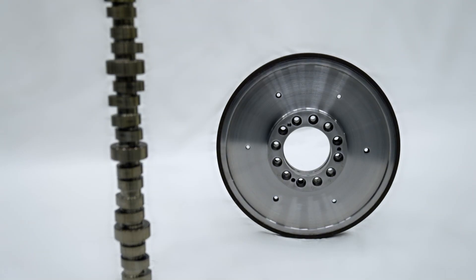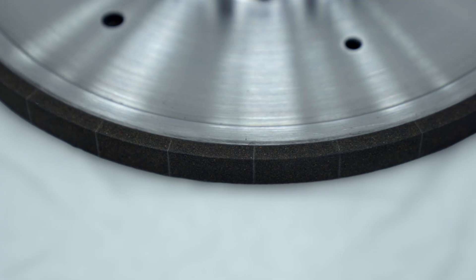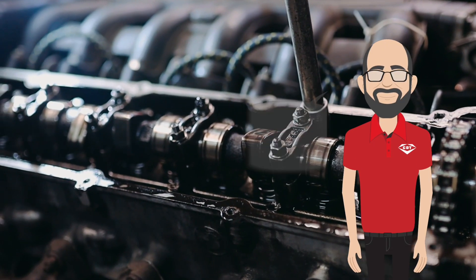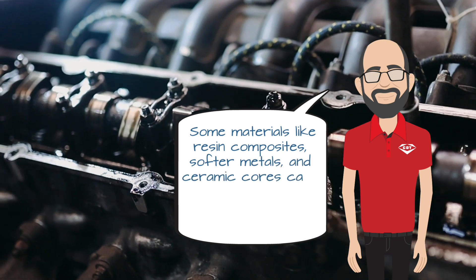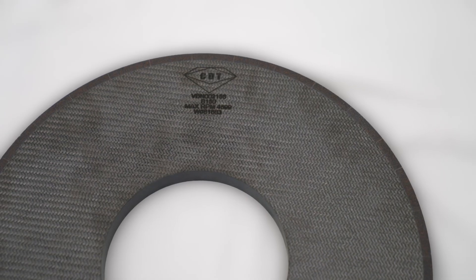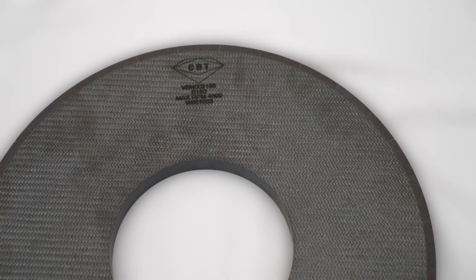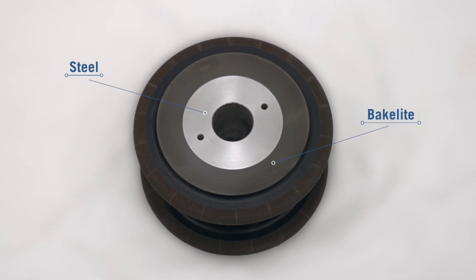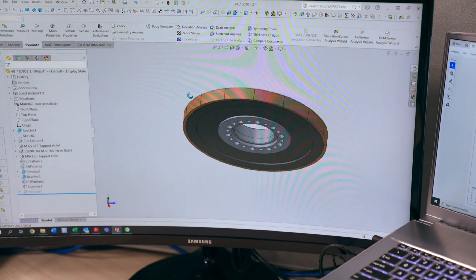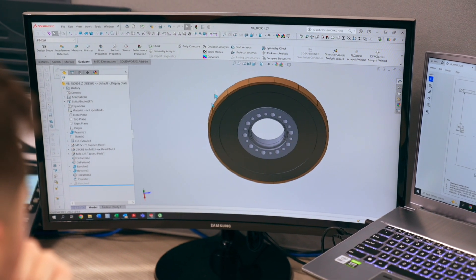However, when you're running at high speeds like camshaft grinding, the process generates a lot of heat with extremely demanding grinding forces. Some materials like resin composites, softer metals, and ceramic cores can't handle the forces required for this application. You're going to need high stiffness, which means a carbon fiber or high tensile strength steel core. We can also combine materials to make a combo core using more than one material that can result in low weight, high stiffness, and toughness without excessive cost.